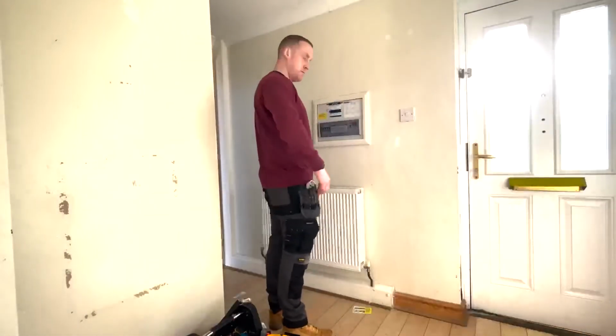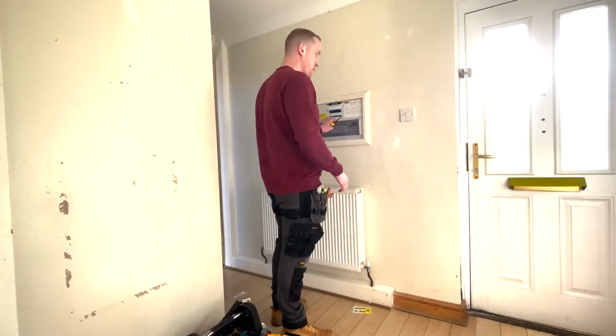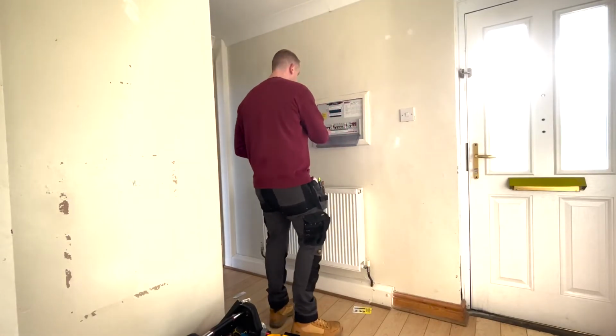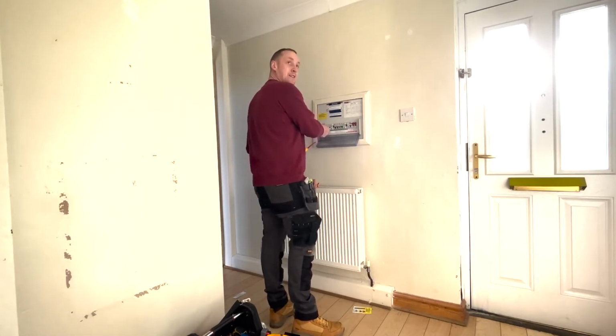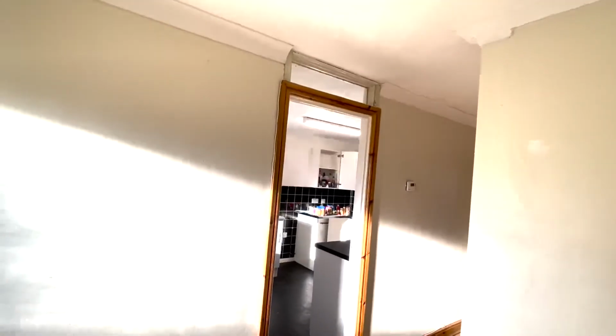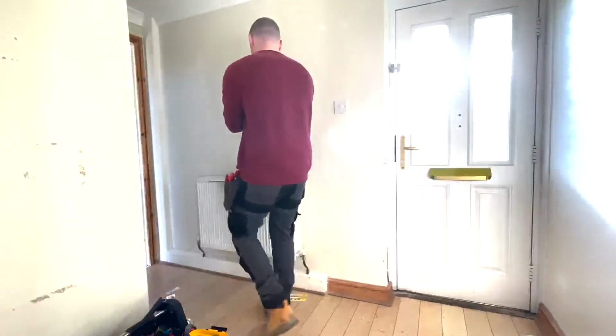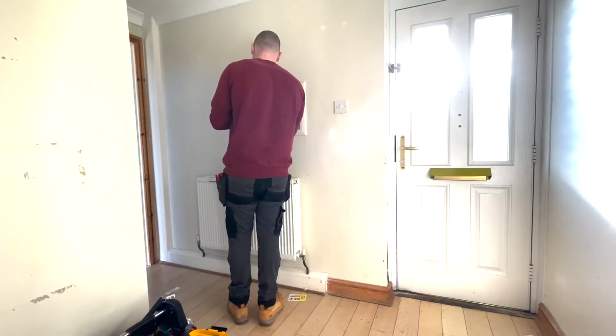Houston, we have a problem. Well, kind of a problem. Lights are no longer working. Just touched it and they're all flickering. Don't know if you can hear it either. It's a weird noise, that. I think the MCB might be faulty, or it might not be in properly, which it should be, because I put it in myself.